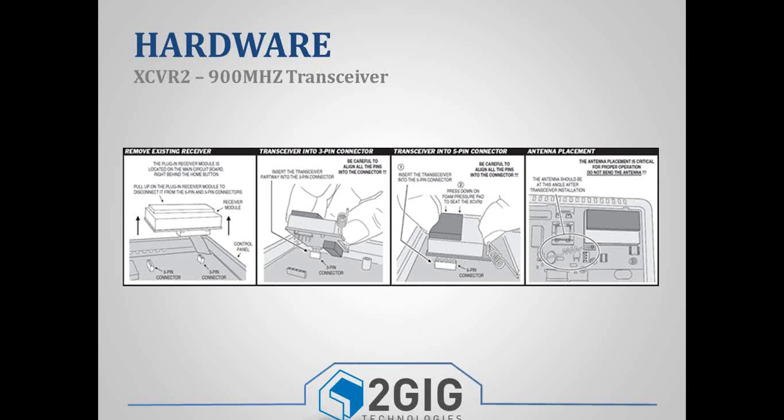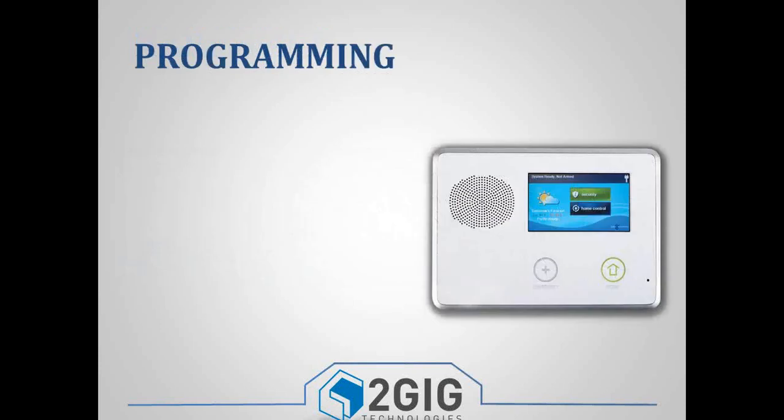So you just need to make sure that before you even power up the panel or do anything, you pull out the module real quick and plug in the new module, this 900 megahertz module. Make sure that you don't do it with the panel powered up. We don't want to cause any issues with the panel. Just do that before you power the panel up, and you should be good to go.